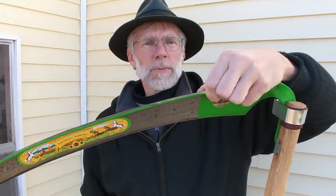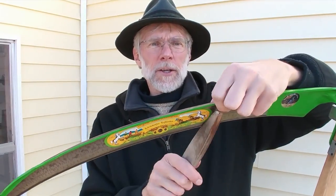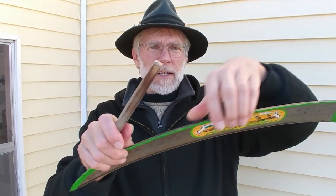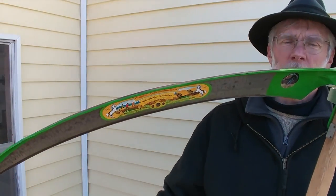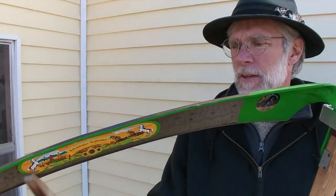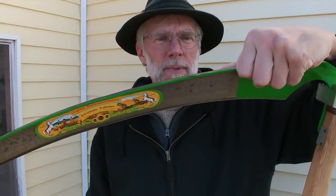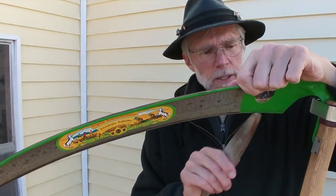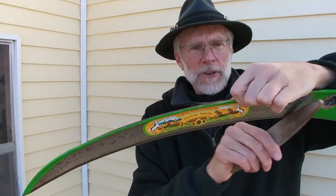It's important to be in control of your scythe blade. Always hold it by the spine and keep your fingers forward as you hone the entire edge. Don't just hold it by the handle and flick the entire length of the blade — it's going to wobble, you're not going to be able to keep the angle exact, and it's dangerous. You could possibly catch yourself. So roll it with a grinding action, moving it laterally down the edge.